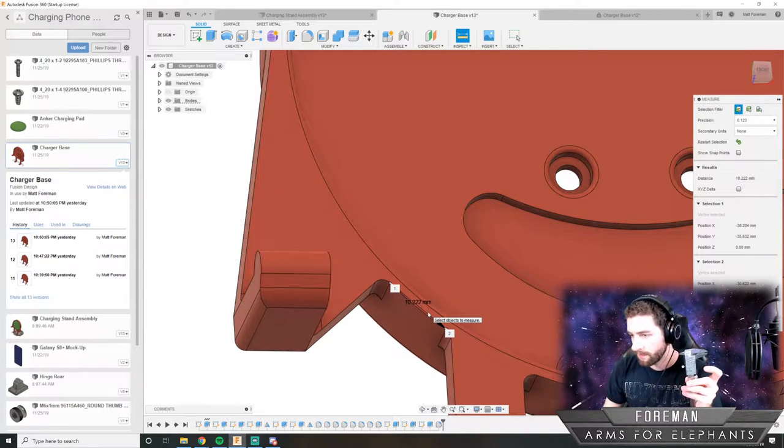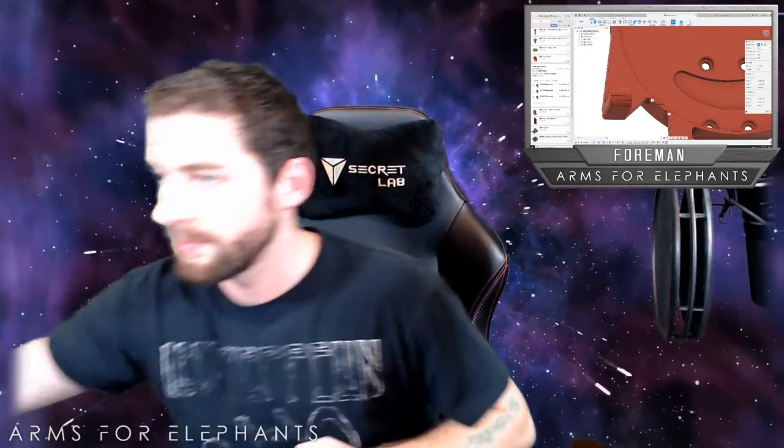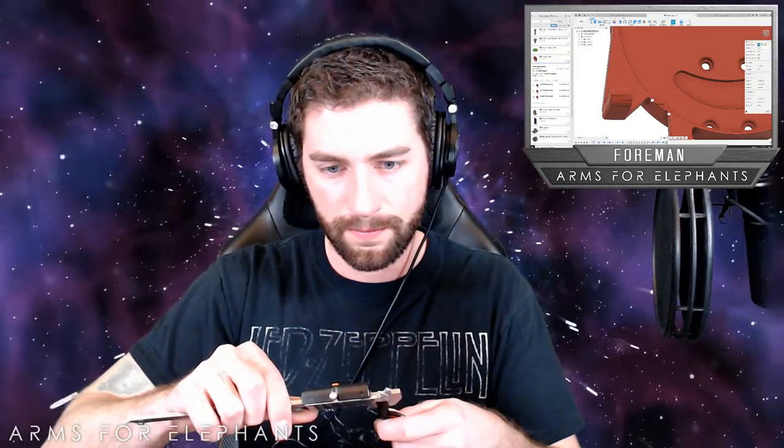And I'm going to take my caliper here. And we'll just see how wide this... I got to grab the charging cord, actually. I'll be right back. All right, so I'm gonna grab the calipers here, and oh, we're cutting it close. This is exactly 10 millimeters, so I might want to take his arm in a little more even. Unless we want like a near exact fit, that might be kind of cool too. You know, I can probably cut into that radius, and it'll be fine.